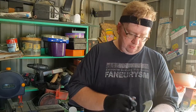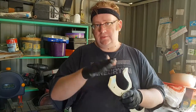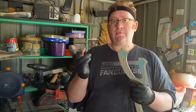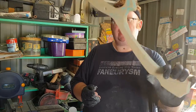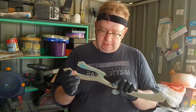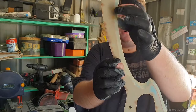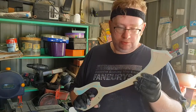Putty will cover most of that up, but you'll usually have to sand down those burnt edges because they won't take paint very well. That's why primers are not very useful. You can probably also see there are all these patches. That's the old wood putty from some of the various layers, and that's just stayed in there. I can rub all that down, but I also need to redo all these scratches that were just basically marked from the spray putty itself.